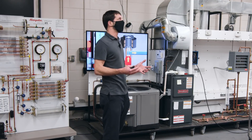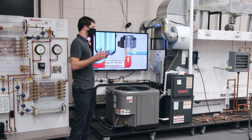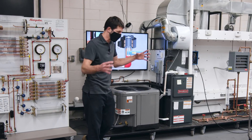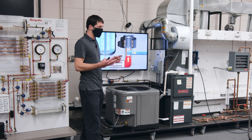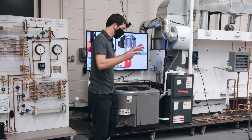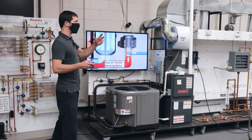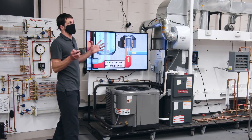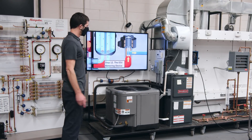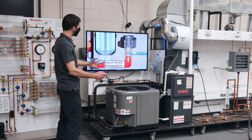That's why you see different alternative and retrofit refrigerants for R-22. The reason they have multiple refrigerants blended in them is they're trying to grab hold of the oil as the refrigerant travels through the system — that's the hard part about retrofit refrigerants. That's also why they may add a semi-flammable or partially flammable refrigerant in that mix, though when added to the mix, the refrigerant blend is not labeled as flammable because of the mixture.